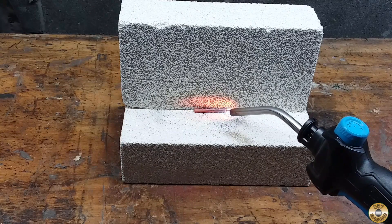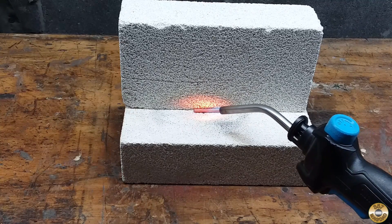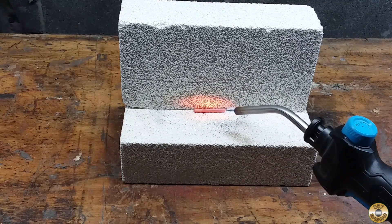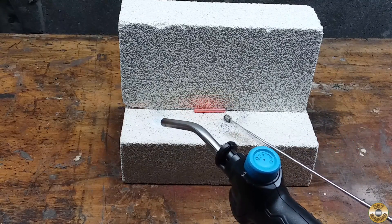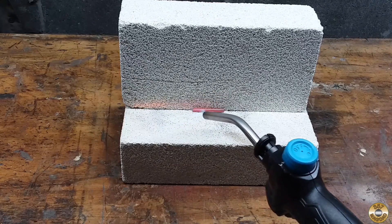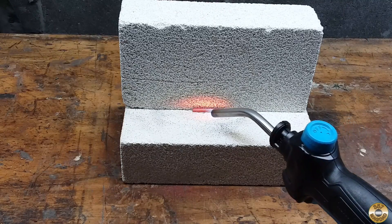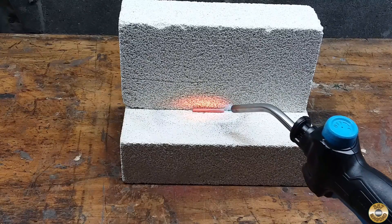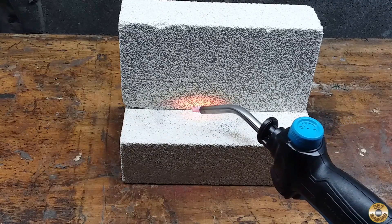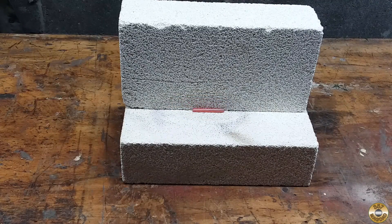In order to demonstrate how heat treating affects the properties of high carbon steel, I cut four roughly equal lengths of the music wire. I heated them up until a magnet wouldn't stick anymore, and then I let them cool in air. In doing this, I am simulating the process called annealing. Real annealing involves using a furnace with precise temperature control — the part is heated to its critical temperature and then slowly cooled over time. For those of us with just a propane torch and a dream, heating the steel until a magnet won't stick and then cooling down to room temperature in air is close enough.